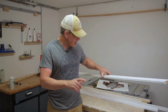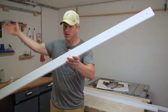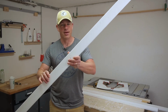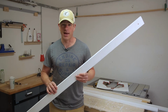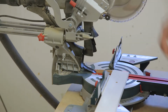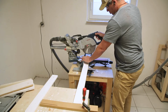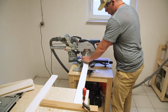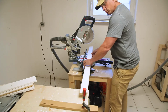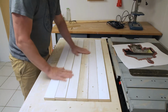I coincidentally have the old Sockelleisten, the baseboard that I took out of the basement, kicking around. So obviously, I'm going to make a Canadian flag. Step 1, square off one end. Next, we cut all the boards to length using a stop block for repeatability. An actual Canadian flag has a 2-to-1 ratio, so I make mine 45 by 90 centimeters. I'll explain more about that later.